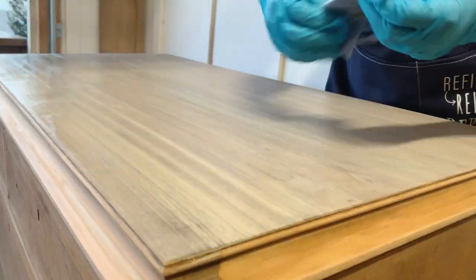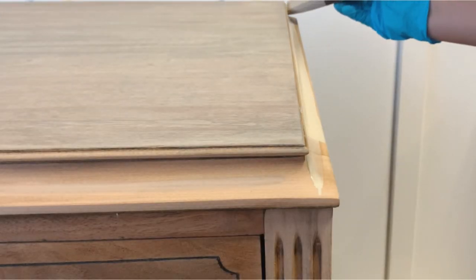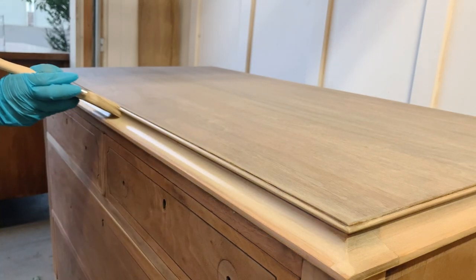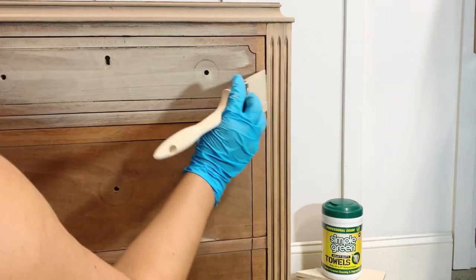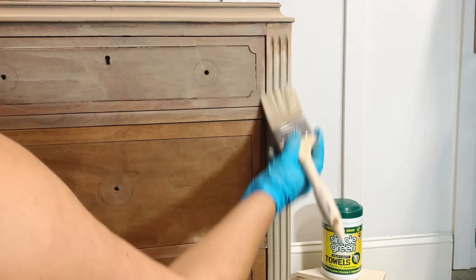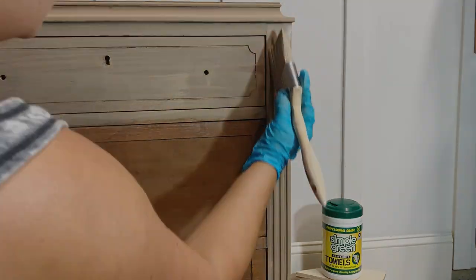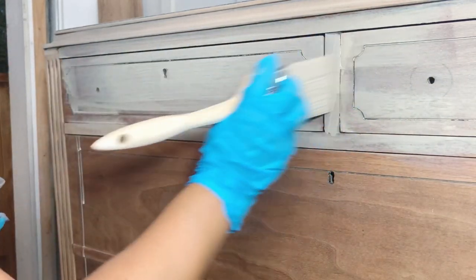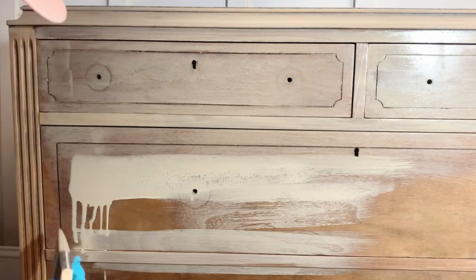The way this technique is applied, you have to have a couple of wet rags ready to go. You brush in your color wash, wait two minutes, then wipe it off with your wet rag, always following the wood grain when wiping. Try to avoid paint drips — I actually had a few here because I was saturating my brush a little too much. If you get drips, go over them right away; you don't want them to settle because they will stick out like a sore thumb. Use your wet rag to wipe them off immediately, then start applying your paint again on that area.